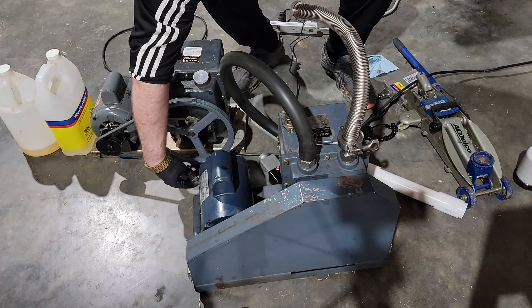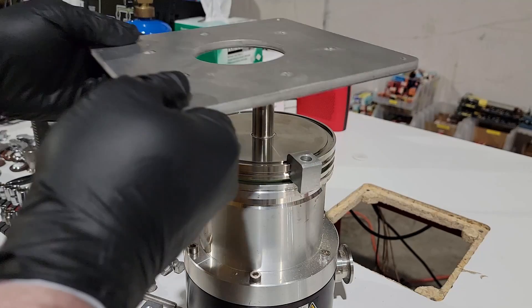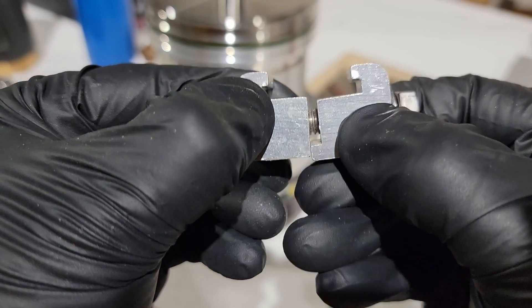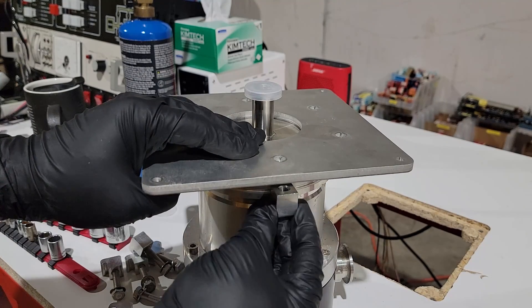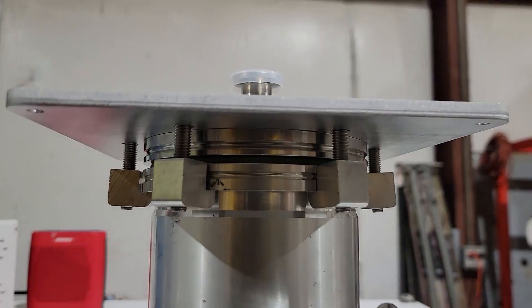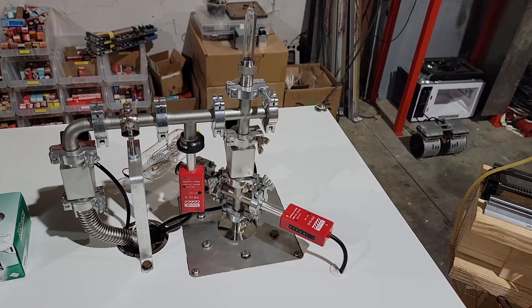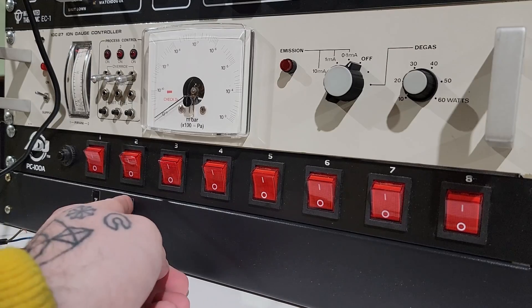After testing, I mounted the filter underneath the workbench using a couple of pipe hangers. I also changed the mounting on the turbo molecular pump because I was a little paranoid about a leak developing in that huge flange. I didn't like the way the clamps sat when I tried to put the entire clamp underneath the mounting plate, so I just got rid of half the clamp and pretended that the mounting plate was actually an ISO-F mounting flange — just bolting it directly up to the flange and letting the mounting plate compress the O-ring, which worked great. I rearranged the top end of the system and added a pipe hanger for more mechanical rigidity, to reduce torque on that flange connection. After that was all sorted, I got out my Dymo label maker and put labels on everything.